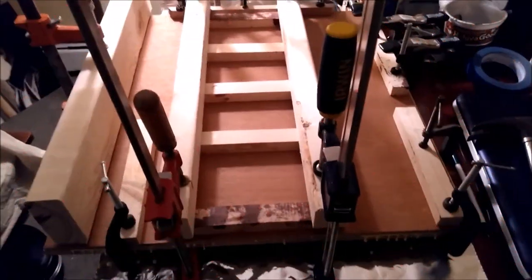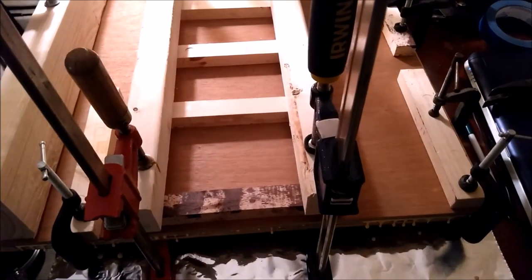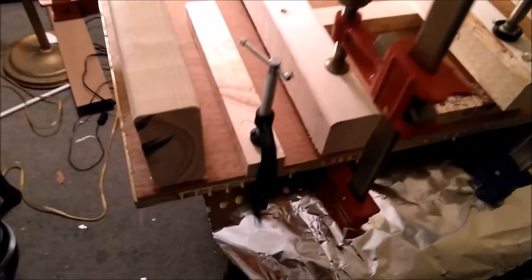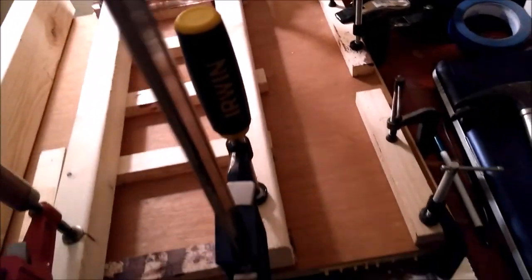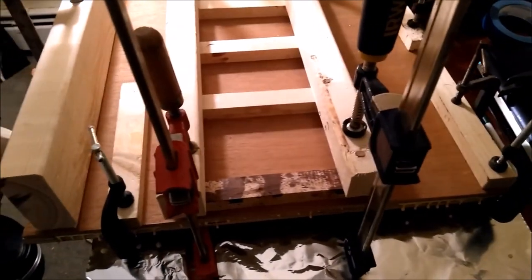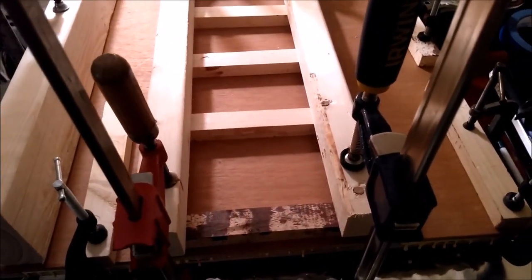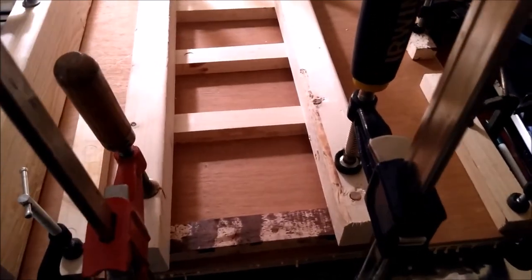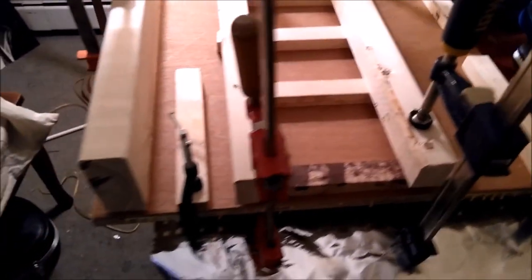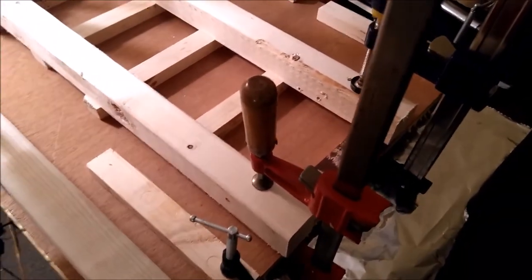I got this all done. I'll tell you what, the best thing I did right at the very start was to put in these little positioning nails. If you're doing this kind of thing, especially with a large lamination, definitely get everything lined up before any glue goes down. Make sure you know exactly where everything is going to line up perfectly. Put your nails in so that the holes are already there, and then pull the nails back out. And then get all your glue down.